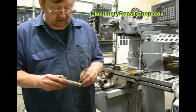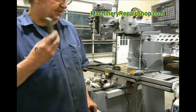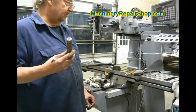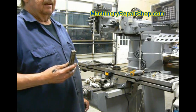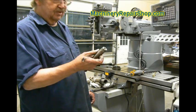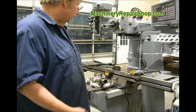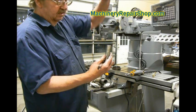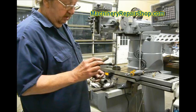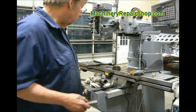The main thing with this collet key and the slot is: if the collet is not stuck and you try to undo the drawbar, it may end up just spinning in there and you'll never get it out. So this just holds the collet as you unscrew the drawbar. Again, it does not drive. If it's driving, then you've got something wrong with the tapers.